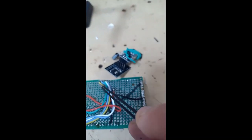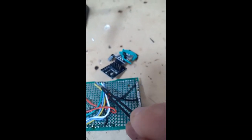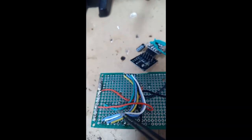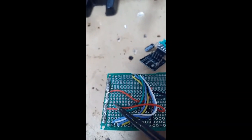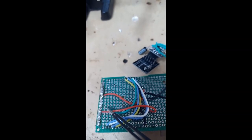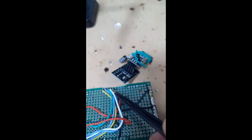After CE (the yellow), then CSN is the blue. Next is the green wire — it is the SCK clock wire and it goes to pin number 13 on Arduino. Next is the white wire — it is the MOSI wire and it goes to pin number 11.